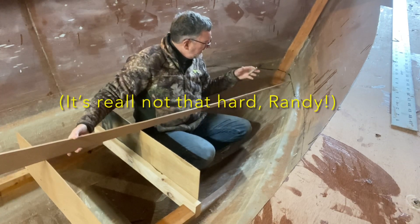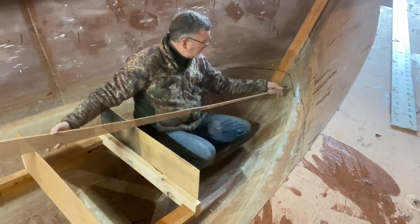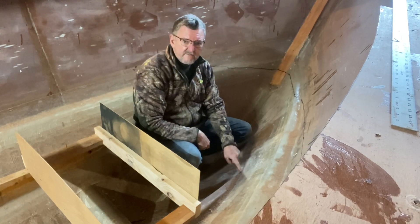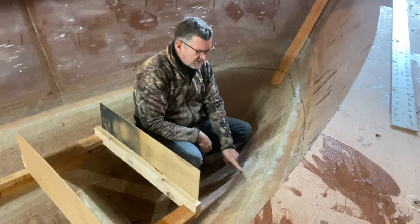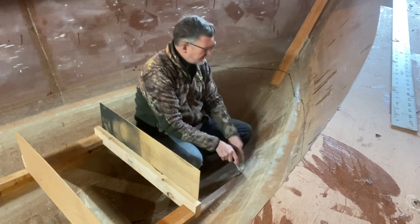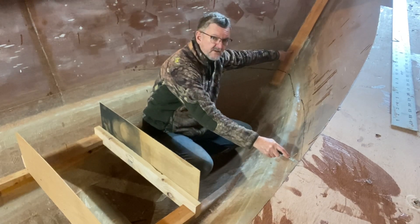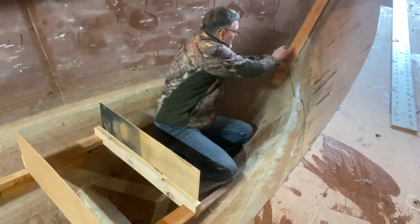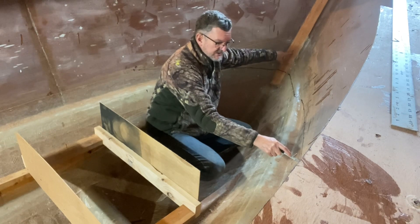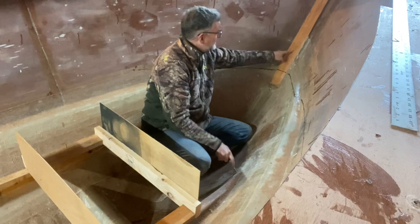With a Sharpie I marked points, then I measured to the point right here in front of the stringers to where the aft of this bulkhead will go, and figured out that was 48 inches. So I marked a point here in the center of the stem, then I measured 48 inches — it could have been anything but it just happened to be exactly 48 inches — to get back to a line that puts me directly in front of the stringers. I did the same thing on the other side so I'm square.